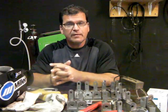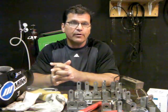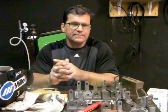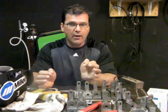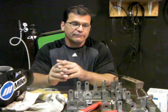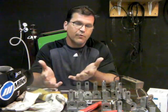So what's better — slow speed pulse or high speed pulse? My opinion is I either want to pulse at about one pulse a second or higher than 30 pulses a second. I had it set at about three or four pulses a second for one of those clips and that was just annoying. One pulse a second you can get in a rhythm, or you can just lay wire. At 30 pulses a second or higher, you don't have to worry about a rhythm — you just weld normally and there's just a background flutter that makes that puddle stick where you put it. It's great welding near an edge, great for filling up a hole, keeps the heat from building up, and it's good for welding stainless steel parts.